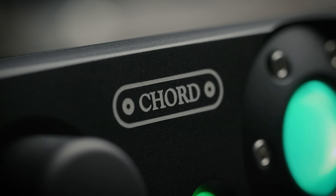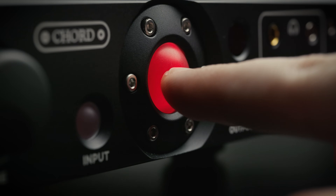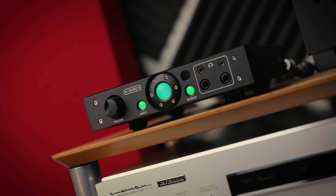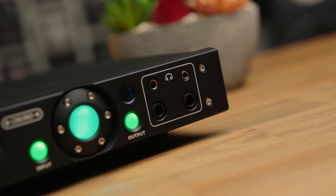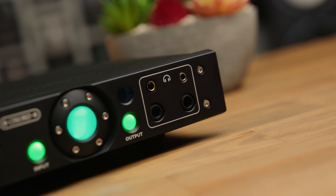The outside of the device is quite distinctly Chord, with the signature glowing glass marbles and controls, an indented volume control and an overall design aesthetic that wouldn't be out of place on the USS Orville. The Alto takes both single-ended and balanced inputs and offers four options for headphone outputs, including two quarter-inch jacks, one 3.5mm single-ended and one 4.4mm pseudo-balanced output. Though it is important to note that the amplifier itself is a single-ended design, so the 4.4mm output is mostly just there for compatibility, but still nice to have.